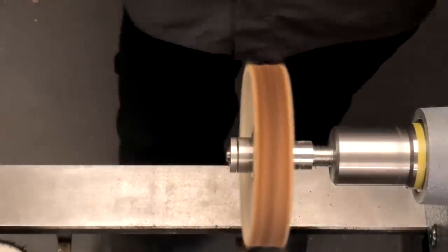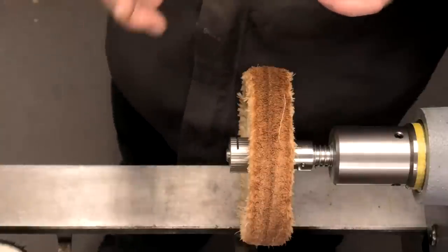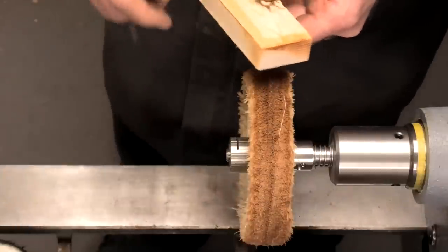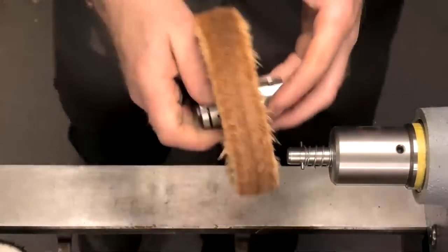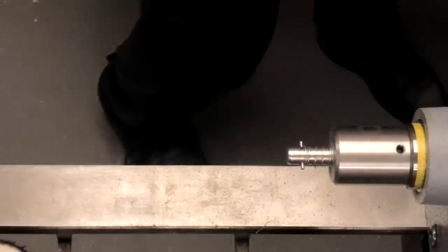If you find your mop's really bunged up, you can go with a wire brush, but you've got to be really careful on approach, okay? But something like a piece of wood would be good just to attack, especially using the corner edges, okay? And easier to control than a wire brush, all right? So, you can see how I've cut that back now. We haven't got as much compound. We've got quite a bit on the corners here. All right, so I'll put that down.